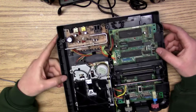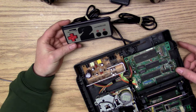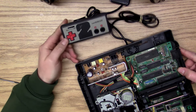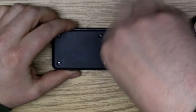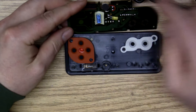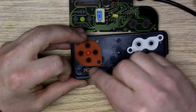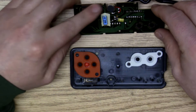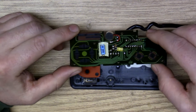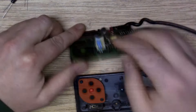The last issue will be the sound problems — that hum we're getting from controller 2. I'm going to crack that open, probably replace the caps in there and see if that cures the sound issue. Inside we have a couple of capacitors we can switch out. The buttons look pretty good actually. I'll probably clean up this little slider here, make sure that's making a nice contact on those contacts there. See if we can figure out why this thing is making a hum sound. I'll get these capacitors swapped out and then we will give it a test.